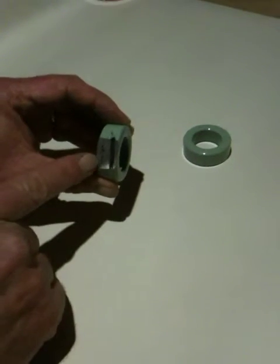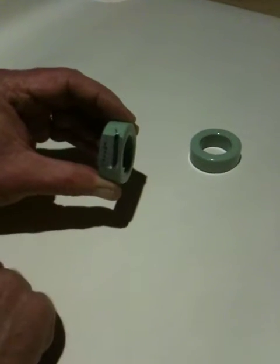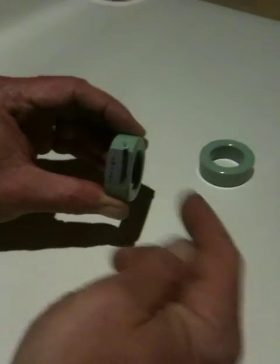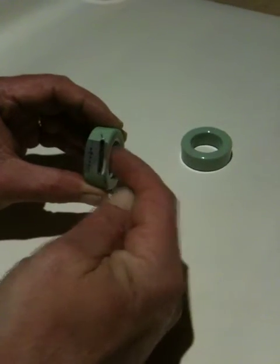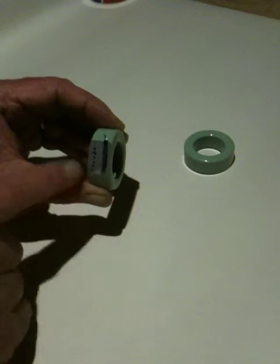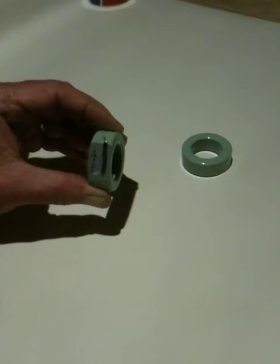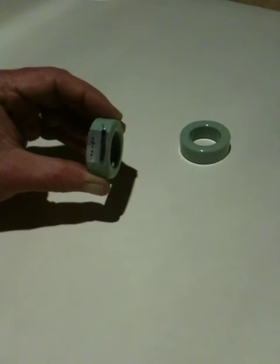And so to get induction, I've got a series of holes here. We'll have conductors going down through those. And when this control winding here is energised and varying — maybe if you're in a tank circuit — then the lines of force will be waving backwards and forwards through this area here, the induction plane, and hopefully getting induction through the conductors. Thanks for watching.